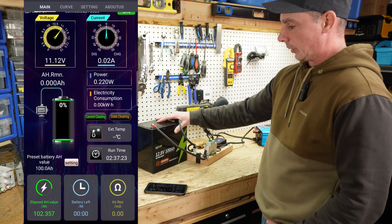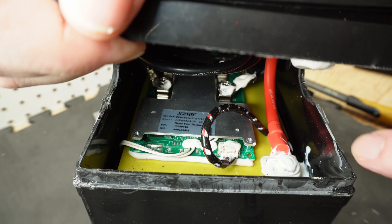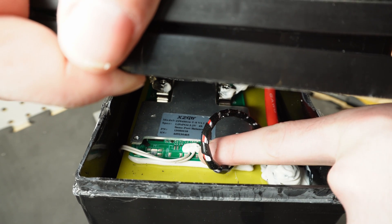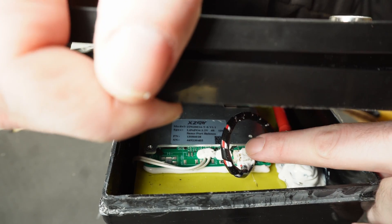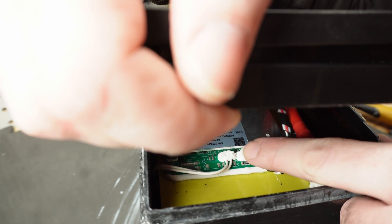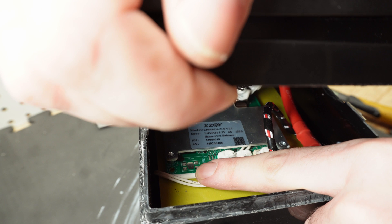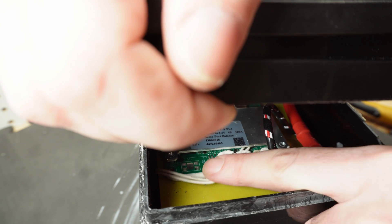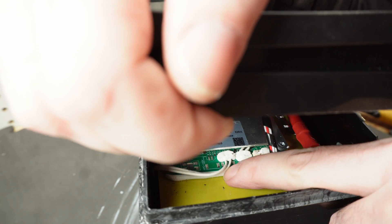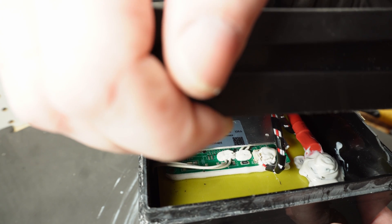Let's open up the lid and see what it looks like inside. I got the lid off as much as I want to — I'm not going to be able to get the pack out. But you can see we have the balance lead cables here, a high temperature sensor with a gob of glue, and another gob of glue here. The same colored wires go back under to the MOSFETs, so that's another high temperature sensor. There is no low temperature sensor here. The BMS is ready to take a heater — if you want a heated battery, that's what the H-plus is for. We also have NTC pads for temperature sensors, with a couple more that can be soldered. So we do not have low temperature protection on this battery, just high temperature.